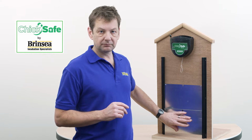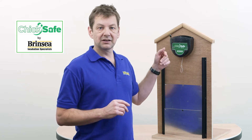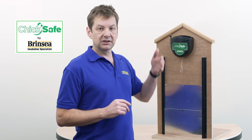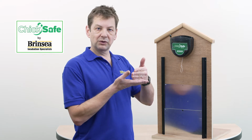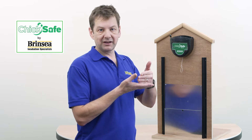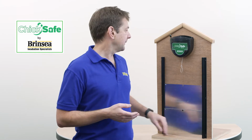and make sure also the door has a physical end stop at the bottom. It's very important because the way the ChickSafe operates is it detects the tension on the string. So as the door closes, it hits the bottom, and then the ChickSafe will realise that the string has gone slack and will turn the motor off. So it's very important the door has a physical stop like that.